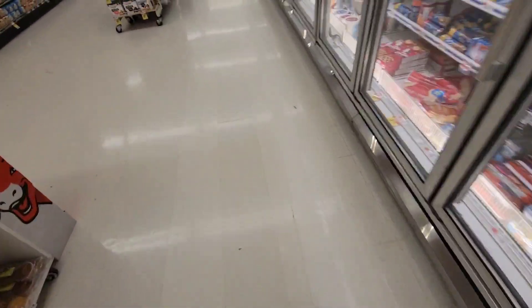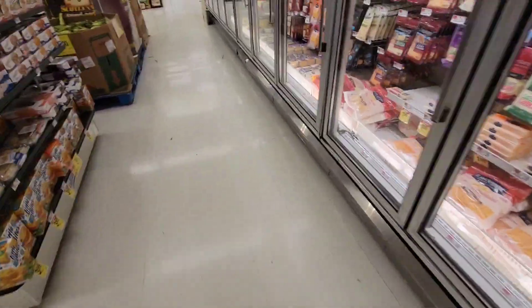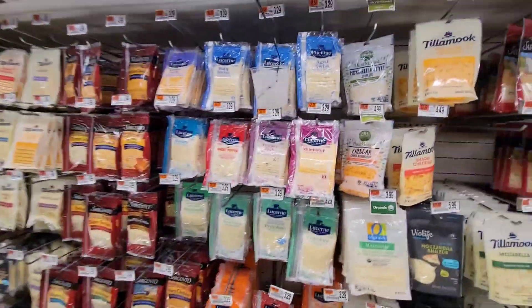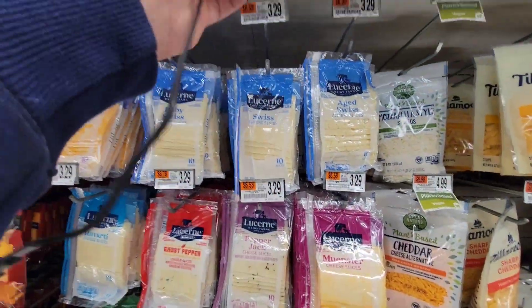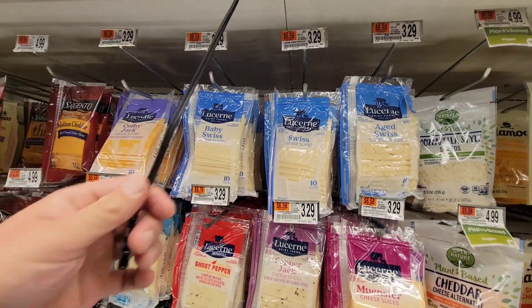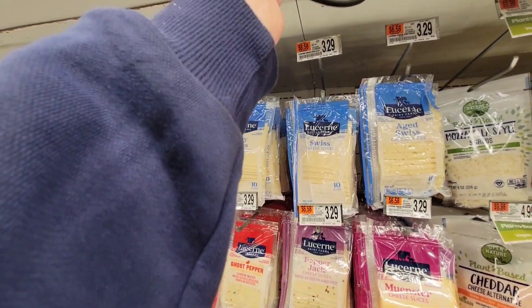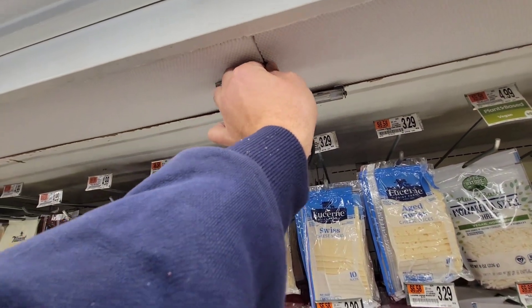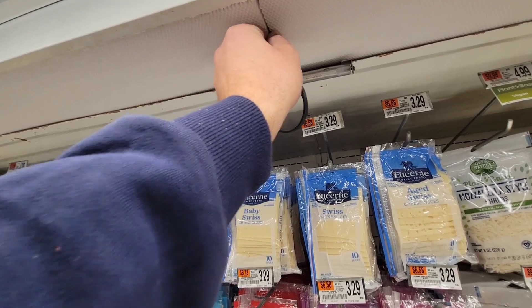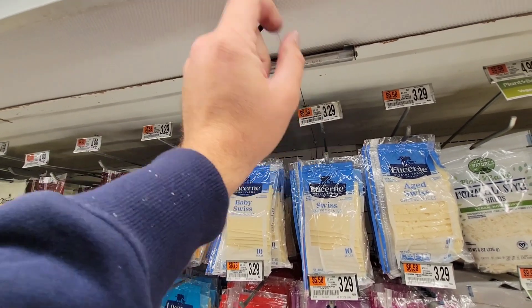Kind of a rudimentary one today, but figured I'd show it anyway. If your temperature probes aren't right — positive or negative offset — it's going to hurt your system and you're going to get alarms. A lot of guys might have torn this thing apart when it's really just the temperature probes. I should mention: I did check airflow first, as I always do, and the airflow was fine. That's what led me to question the temperature probes — the references in the case were indicating those probes might be reading a little off.